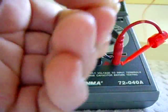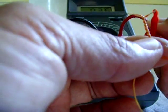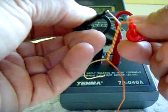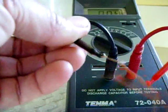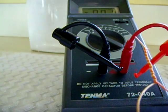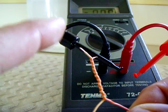Keep twisting. Don't worry about it getting long, because you could just fold it over a bunch. Let's see what the value is now — it's 2.7 now. So it slowly goes up. I notice if you use the enamel wire, the magnet wire, it goes up fast and you can make this much shorter. So that's the way you want to go. If you do this and you need more than a couple of picofarads, you want to use the magnet wire.